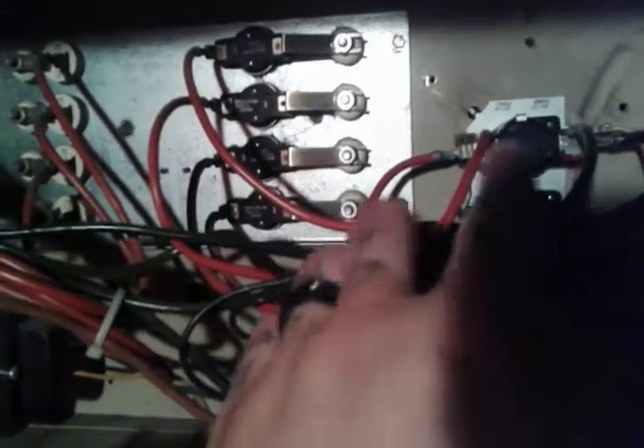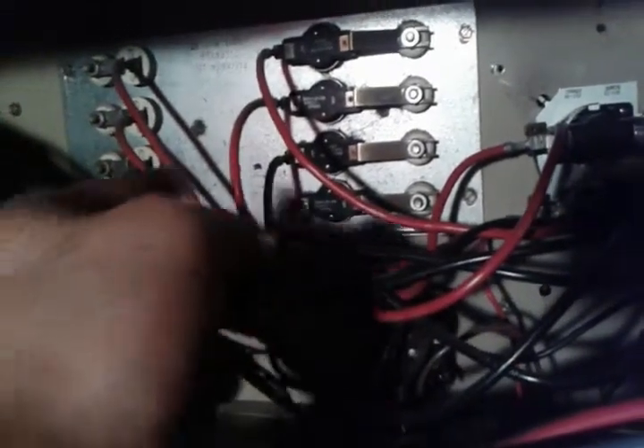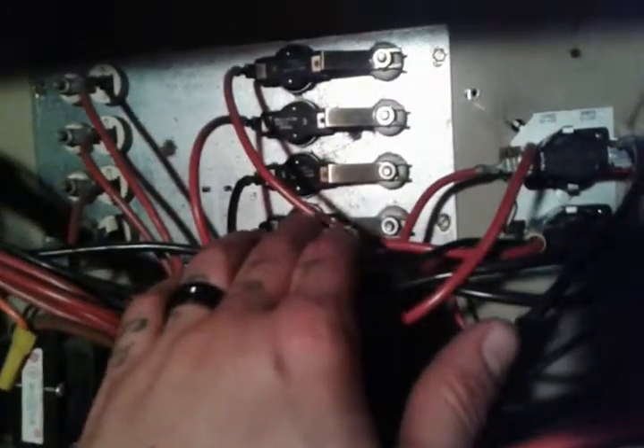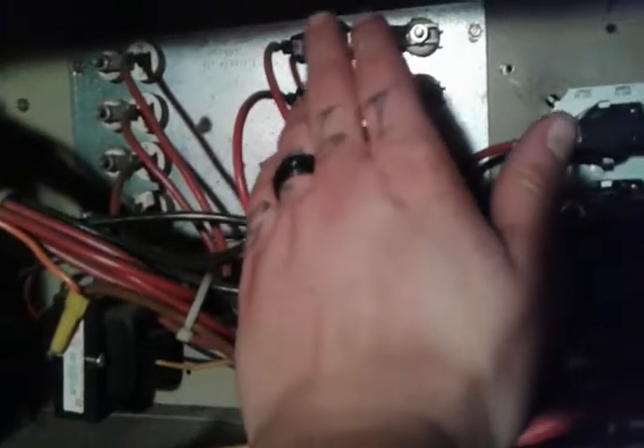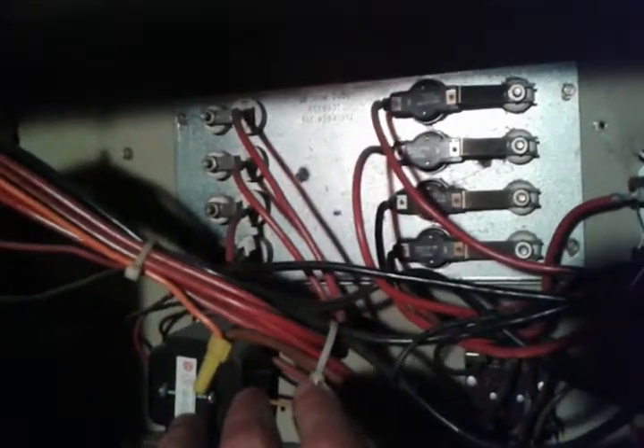There are our sequencers. What these are doing is controlling our heating elements. Each heating element is a coil of nichrome wires running back and forth, curled around here and out to this side — each coil here. What the sequencer does is exactly what it sounds like: it sets these off in a sequence. After about 30 seconds, this first one will heat up. Another 30 seconds to a minute, this second one will heat up and energize, and so on. The resistance going through the wires is what actually heats them up — they've got a lot of resistance, so they're releasing a lot of heat.